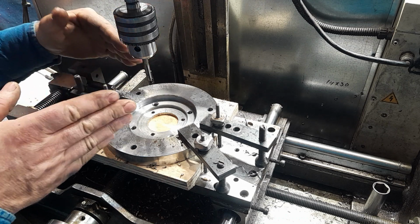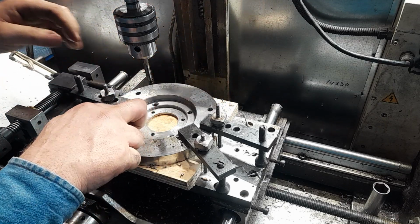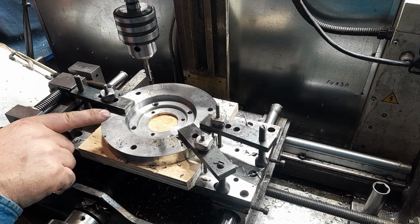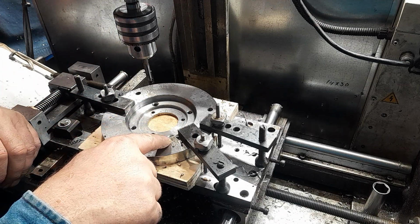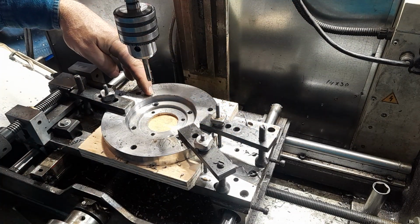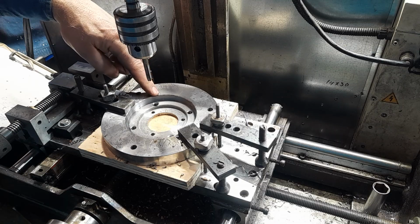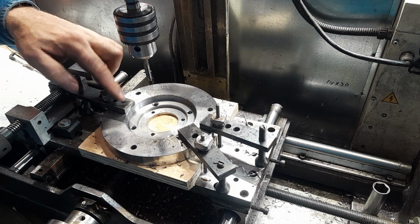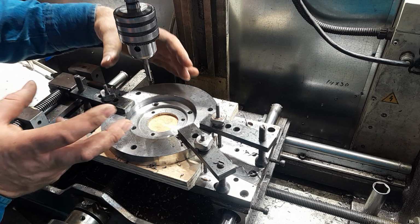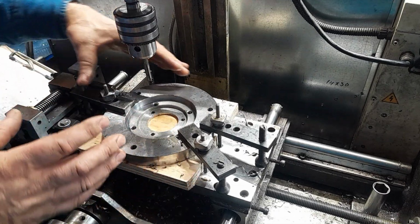But I just wanted to show that this is a 90-degree offset on these 3 holes. This is a 45-degree offset. So we've got 45 degrees, 90 plus 45, 180 plus 45, and 270 plus 45. So our end hole is 315. That'd be 360 minus 45. So that's how you've got to figure offsets on this crazy DRO.